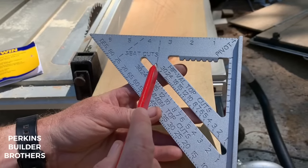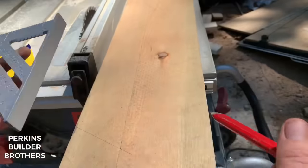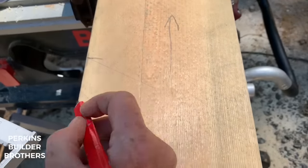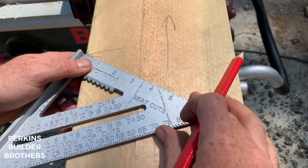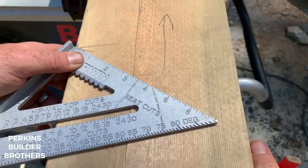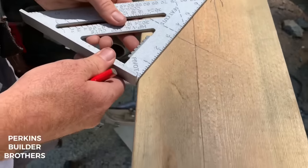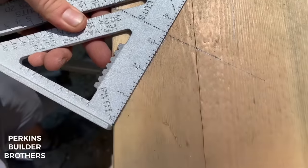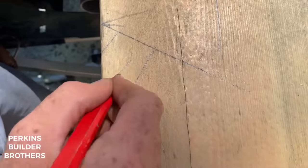This dotted line is used to do your seat cuts, also called a bird's mouth — that's where your rafter sits on top of a wall plate. Let's do a mock-up: the rafter tail is this end of the board, and I know the measurement to the outside of the wall plate on the bottom of the rafter. So I'm going to mark that point. Say this is a 7-12 pitch rafter — we're going to mark on 7 and draw a line. That's the vertical line of the bird's mouth. Now line up the dotted line with the line we just made and mark back across. That's a bird's mouth for a 7-12 pitch on a 3-and-a-half-inch wall.